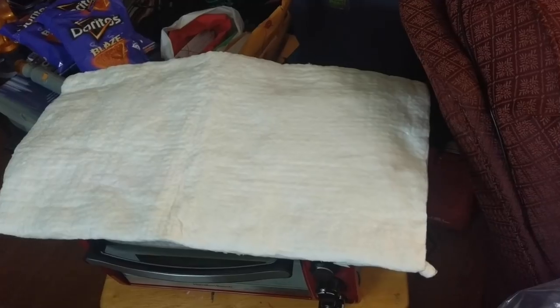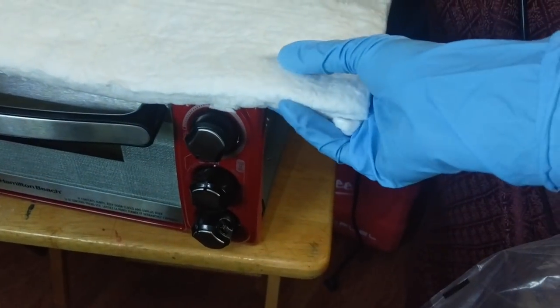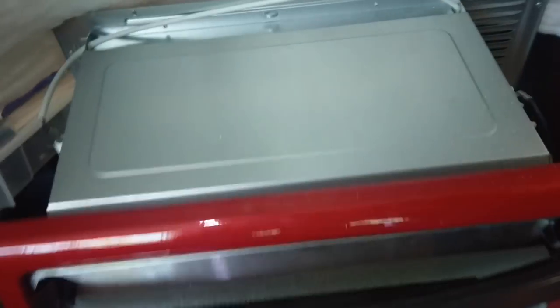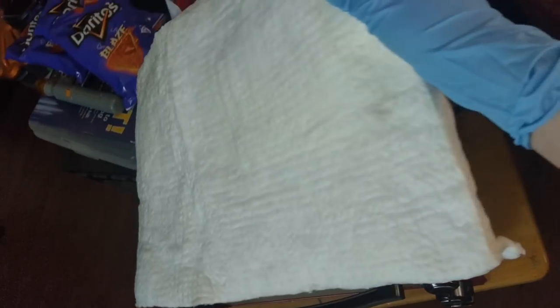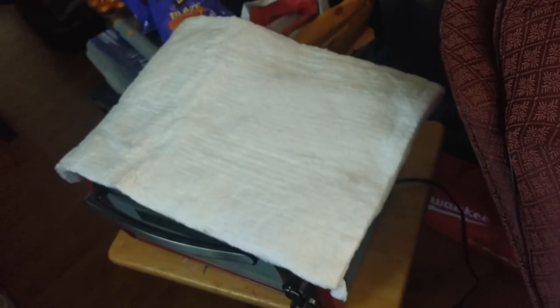Here's what a 1-foot by 2-foot sheet of half-inch ceramic insulation blanket gets you. It's thick and weird — it's got like a crunchy feel, you can just feel the fibers. We're wearing gloves; I don't want to get this stuff all over. Even just picking the blanket up, I'm seeing a bunch of little particles falling off — probably ceramic particles. Just be careful with this stuff; it'll probably make your skin itchy. We're going to try to cut it around the heating elements and wires, leaving access so we can put the solid-state relay in later.